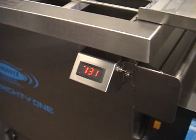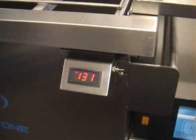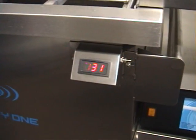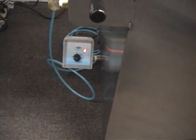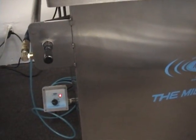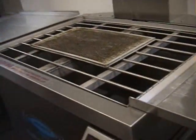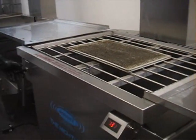I just want to point out this is the temperature we're working with right now — it's 131 degrees Fahrenheit. Typically somewhere between 120 and 140 is where we're going to operate for this. There is a heating system on the machine so all you have to do is pick the appropriate temperature. We're going to be utilizing this handle here to lower the pneumatic lift — with whatever objects we put on it, however many filters can fit — into the tank. Go ahead and lower that in.